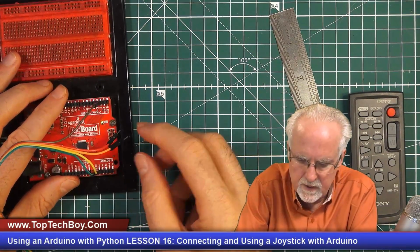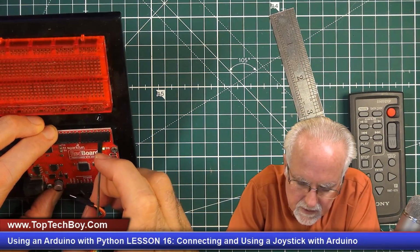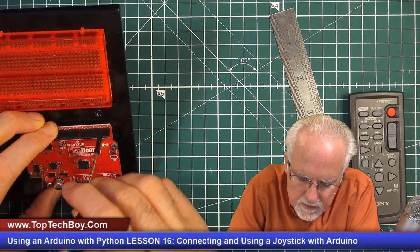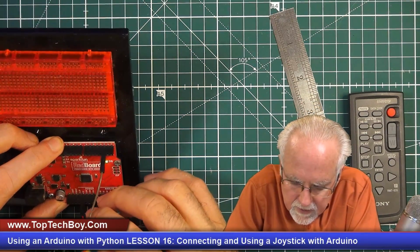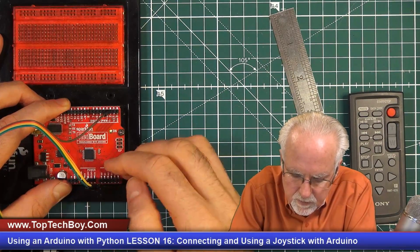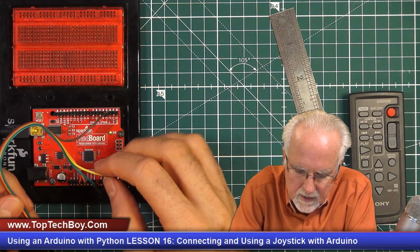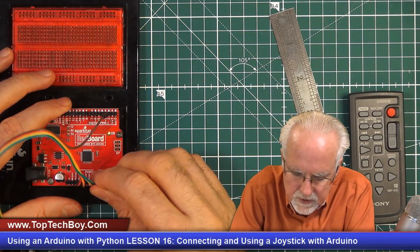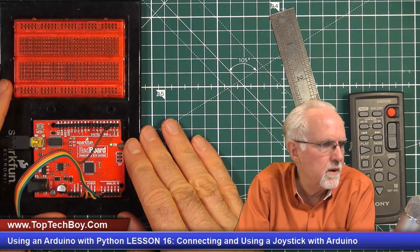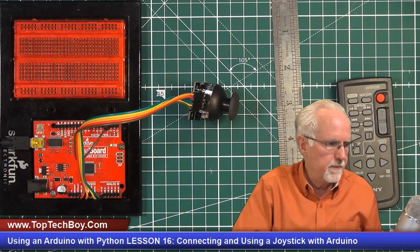Now I've got the red that is going to go to 5 volts, and I have to tip it to see it here with my real eyes as opposed to looking at it on the camera. The last one all the way over to the right is ground, and ground is right next to 5 volts, so we will put that there. I lost these two, so let me come back. The yellow is Y, and that is A1. And then my green is X, A0, and we are like that. I think we are hooked up there. Let me put this over here again where you can see it. So I think we have our circuit hooked up at this point.